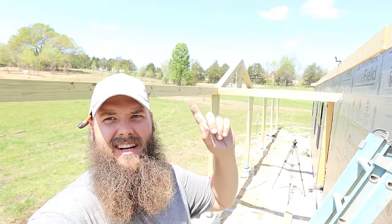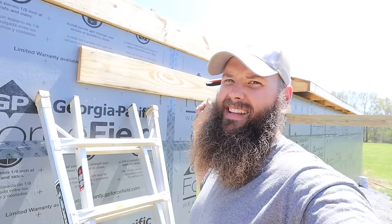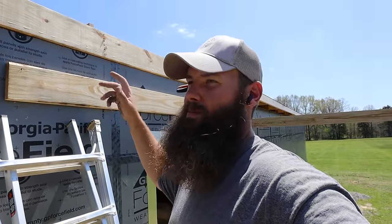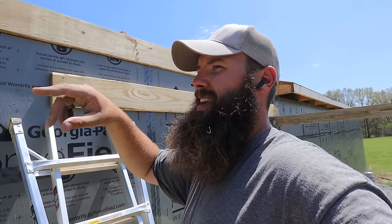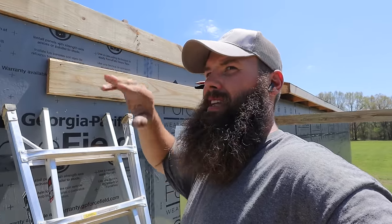Okay, so as you saw, we got the arch in, and it's really bright. But next step, we have to add this nailer to the house. So we're gonna have to make our rafters. They're kind of gonna look like trusses, but only half of a truss. So we need something to fasten into. So we snap the chalk line all the way across. It's hard to see here because it's underneath that board. That's a 2x8. We'll run it across. We'll skip the middle because we don't need one there, because we're going to go up with our metal above the door, and that'll be a vaulted ceiling.